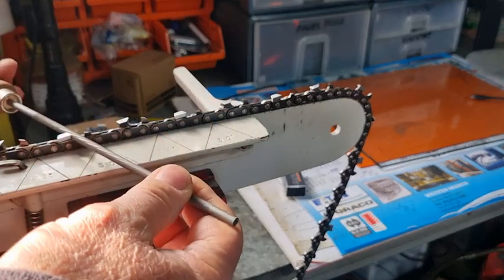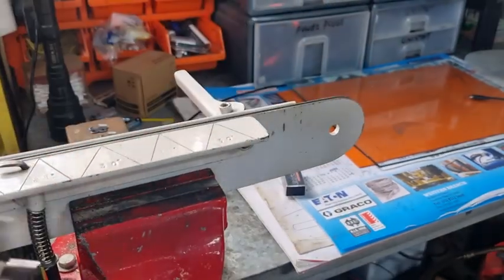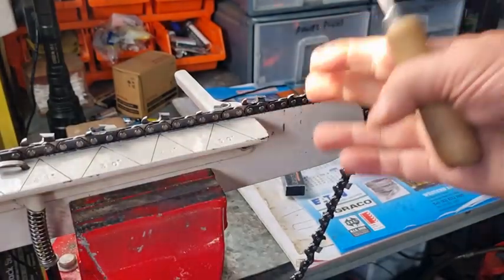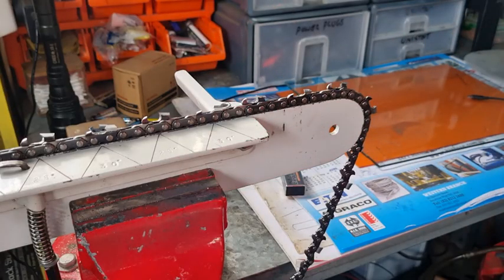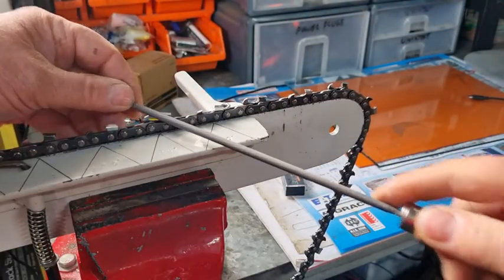But if I swap to that side, I'm going to use my left hand. But there is an alternative — if you swap the chain around to the other side, then I can come from this side with my right hand and file this way. It's interesting how people file. A lot of people find out that they can't file with their left hand and only want to use one hand. I find that if I alternate and turn the chain around, because this is a right-hand tooth facing from the back, I can use my right hand on a right-hand tooth.